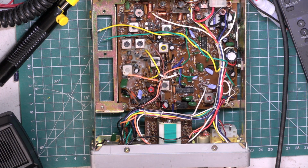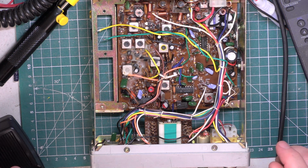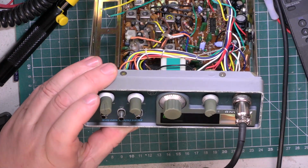So, it's coming in at what? 0.95 of a microvolt, and it's going out at 0.65 of a microvolt. So it's a lovely squelch action. There's nothing worse than having a squelch that takes 10 dB, and we've had that on some sets. 10 microvolts to open, and not good. So that works great. So other things to check.